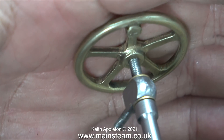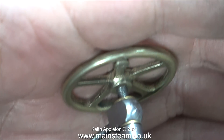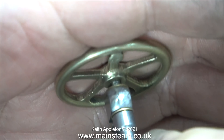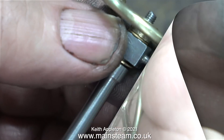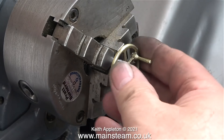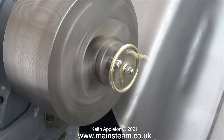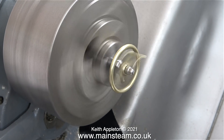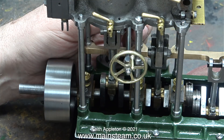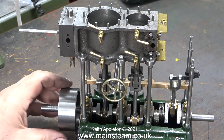If I do any more cleaning I'm going to slip into a coma, so I'll move on to the more exciting part: fitting the hand wheel to the shaft. The clearance between the shaft and the bearing that mounts onto one of the columns is critical — it wants to be neither tight nor slack. I mount the shaft in my Myford lathe and correct a bit of eccentricity, and with some gentle persuasion the wheel runs quite true — more than good enough for the application. Holding it in place on the engine, when I compare it with the old hand wheel it's no contest.